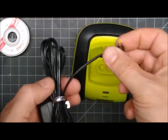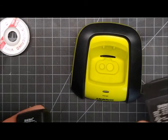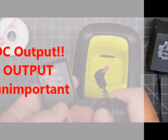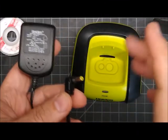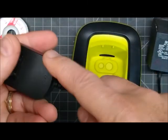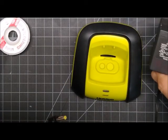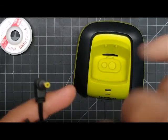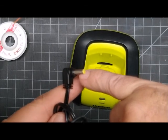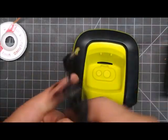The tricky part would be the plug. If you need a new power adapter, maybe you could go to a thrift store and find a 24 volt power adapter, cut the wire off, and make sure you get the polarity correct. Because you don't know what that power adapter is — they're usually marked with a stripe, but who knows if they wired it up inside the same way. It should be center positive. Put your multimeter in there — you might need a bent paper clip to stick down into the hole. The outside should be ground and the center should be positive.